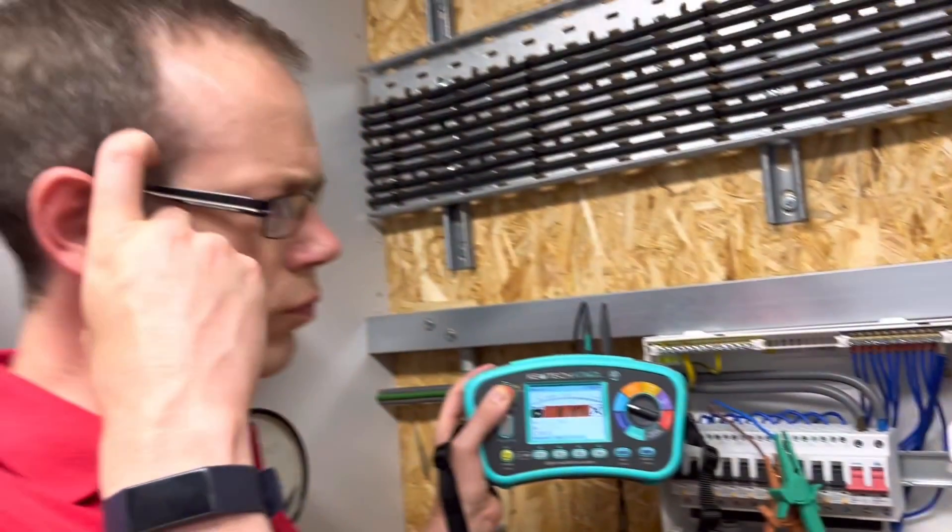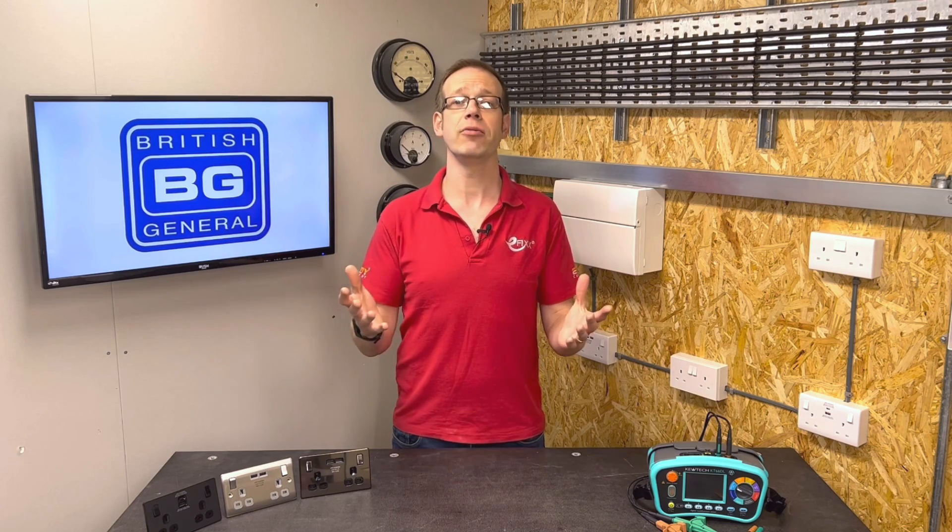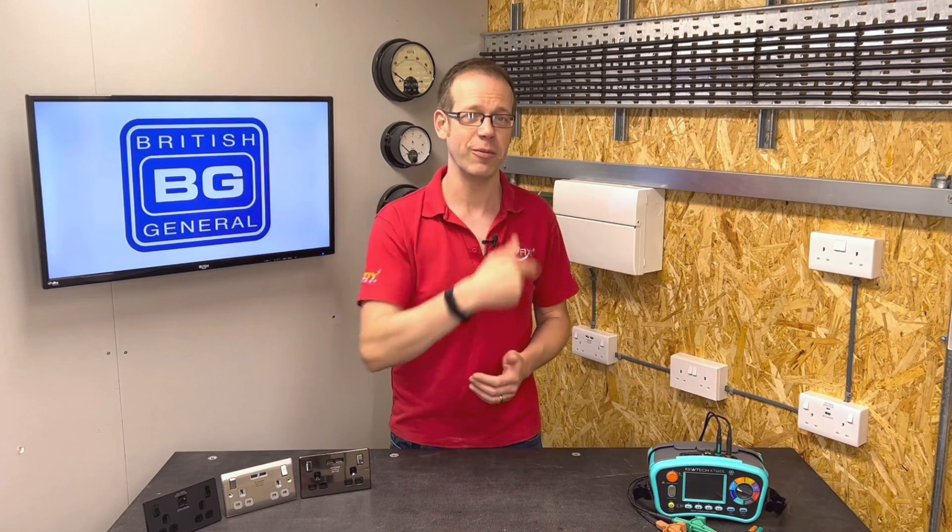You could even theoretically test across line and neutral with this socket on either 250 volts or 500 volts and you won't cause any damage to it. There's no reason to, as the regs no longer require you to and you'll get a misleadingly low reading — but due to the change in regs, you're not left scratching your head trying to figure out if that's from a fault or from an installed socket outlet with the USB charging point built in. For more information on wiring accessories and the wiring regulations, check out our free training package to help you with your CPD. You'll find the link in the description, and thank you very much for watching.